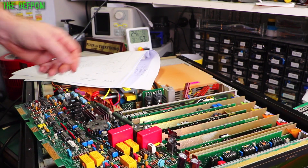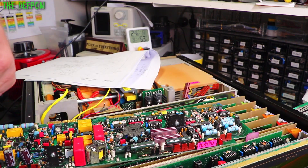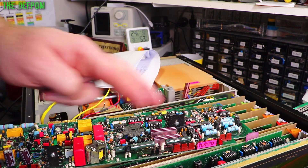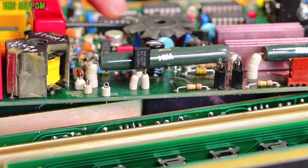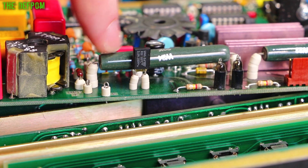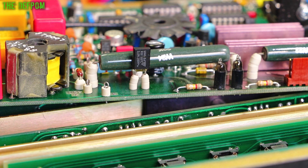I've got to replace this fuse. The fuse is right here - it's a bit of an unusual one. It's this block here standing up at the board. Never seen one like before. I do have some fuses, I can probably just replace it. But it's odd that it's blowing because I can't see any reason for it. I've realized what's going on with this fuse now - I just had a closer look at it. Notice on there it says 150 degrees C. It's a thermal fuse, which is against this resistor. Obviously it's there to protect if this resistor is getting too hot. So it's got a thermal fuse which has failed. I might have some thermal fuses but I don't know if I've got one that's the right size or value.